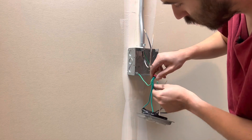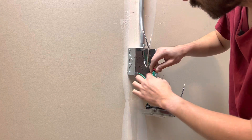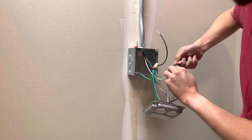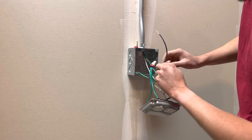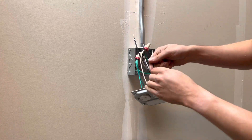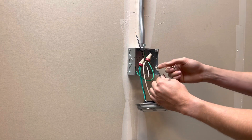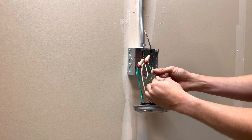Always pull on your wires to make sure they're not going to be coming out anytime soon. My neutral is going to go to my neutral and tie together with the neutrals. I'm going to hopefully pick the right wire here to tie these together. My receptacle right here is going to go to one of the wires for the switch leg for my receptacle to have the switch plug, because I didn't make that direct connection — so I'm going to do that with a wire nut.